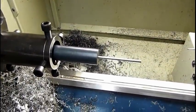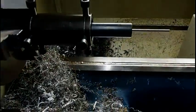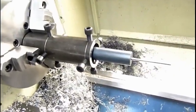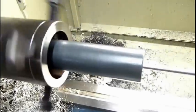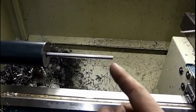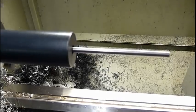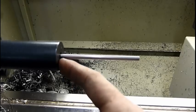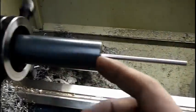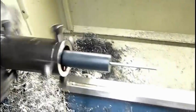So that when you shoot, any deflection that influences the barrel direction might have on the bullet, it influences it up — not to the left or to the right. Let me turn this on so I can show you. This is only set at 100 RPM. As you can see, that part of the barrel is running really nice. This one is running out just a hair — the whole thing looks pretty square, it's just moving up and down just a little bit. But the barrel is square. What that says is that the bore, when it was gun drilled and then reamed, was not drilled perfectly centered to this blank. So that's why it's important to dial in on your bore, not the outside. You dial in on the outside to get it first zeroed, but then dial in on the bore.